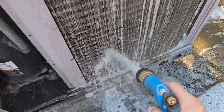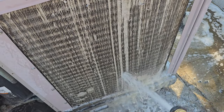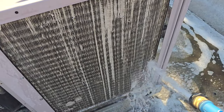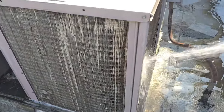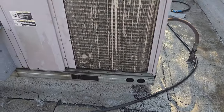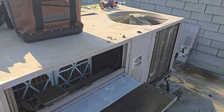There's stuff coming out — we'll just get all sides. We'll rinse multiple times because this is a very corrosive cleaner. It etches the coil. Why didn't I use the yellow? Because this coil is really dirty internally and I can't split it, so I need foaming action that's going to push through. It's not ideal to use a brightener cleaner on stuff because it literally etches the coil, but this coil is already destroyed — you can see it already has fin separation, you can see copper. This coil is done anyway. We're just doing a good rinse, put back together. I did my best to wash all the stuff away from the condenser so it doesn't suck back up. Filters are pretty dirty. I moved my air probe in here so it gets a better reading. I'm going to clean out that trap really quick since I have a hose, and then we're going to turn it on and see how it's performing now.